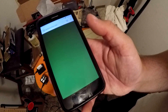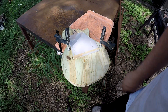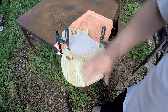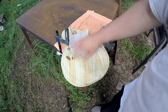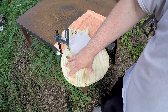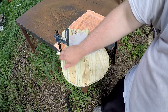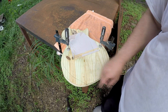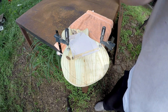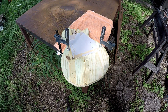Five is green — all right, it's going to be a green guitar! I got a little bit ahead of myself — I started routing out the pickup cavities and I don't want people to see that just yet, so I've covered it up. I'm also going to start changing the shape — I'm going to do some body comfort curves. I'll set my jigsaw at an angle to cut that off nice and sand it out smooth on the back and inside so it's a little more comfortable to play.